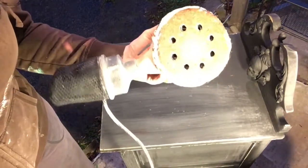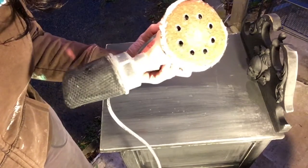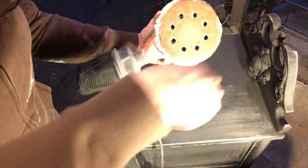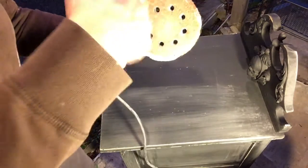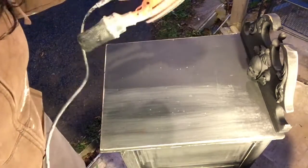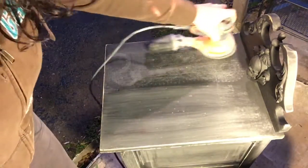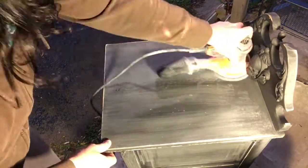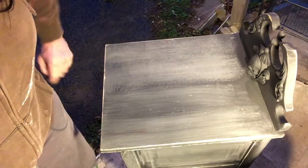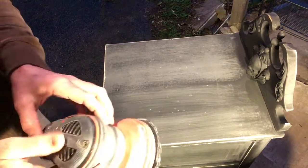This is an orbital sander — the sandpaper from this is what we used earlier to distress the cracks. This is better for sanding before you paint a piece. You can sand afterwards, but since it circles as it sands it can leave circular marks in your furniture, making it obvious you used an electric sander. You can try moving it fast to minimize the circular patterns, but it's not ideal for chalk paint — though great for sanding a piece before you chalk paint it.